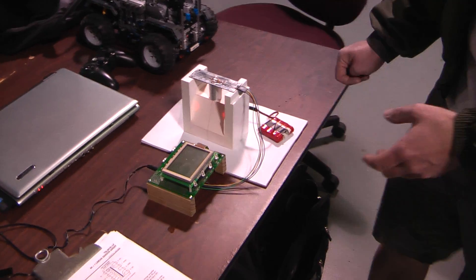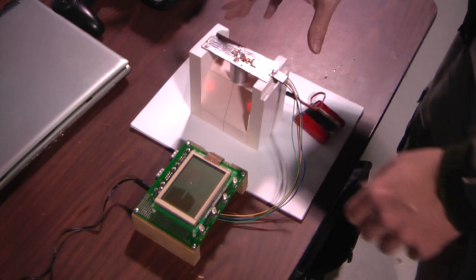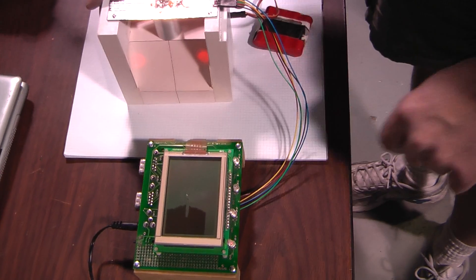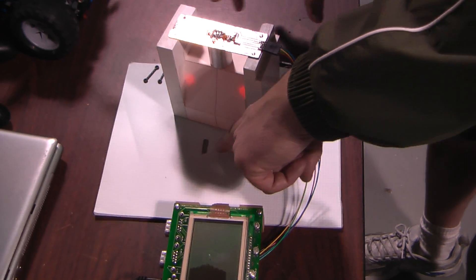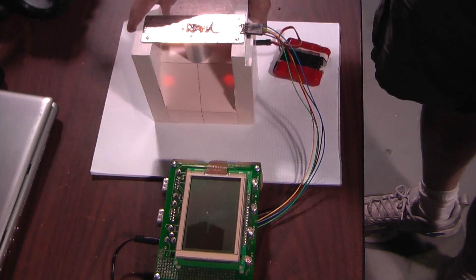What it is, is it's an 8-pin chip, or an 8-pin DIP package, with a 64-element linear sensor array. And as I move the array, you can see that bar graph. And what the bar graph is showing us, as I move the setup away here, is it's looking at that line, but just in one dimension. The bar graph is showing us intensity levels.